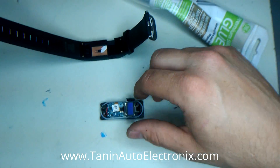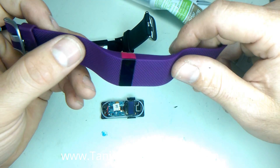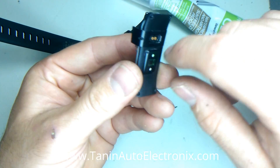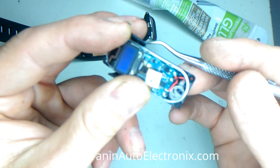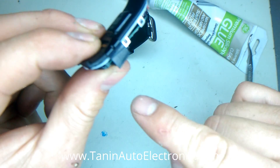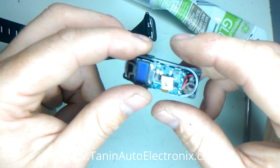The first thing I did was fill this hole — you can see it's filled up with silicone on this one. I haven't noticed any real difference in step accumulation with it filled. If you take this out you'll see the hole — this pick goes through the hole and you can see it come through the other side. What you do is put some silicone here, use your finger and push it into the hole, and do that two, three, or four times. If you look on this side you'll see a little mound or blob of silicone — that's when you know you're good to go.